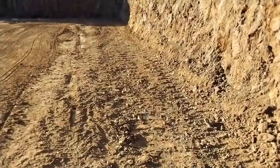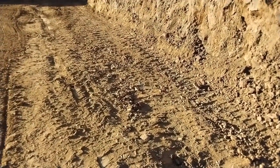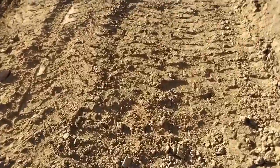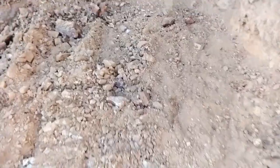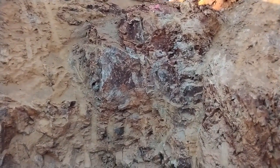Tomorrow, before we get too much further along, I'm going to stop and clean out all the footings. The footings were full of flowable fill - the actual concrete footing has not been poured yet. When we dug these they broke out so rough that the engineers and geotechs decided to pour flowable fill. The center line of the wall is this white dot here. The concrete guys will form on top of the flowable fill, cast the footing, embed all their steel - there are the other actual wall corners - tie their walls, and the walls go all the way up to the top, about 20 feet.